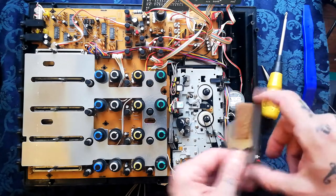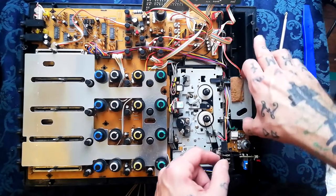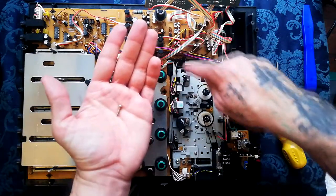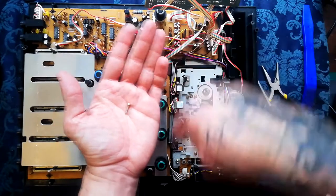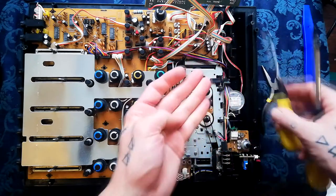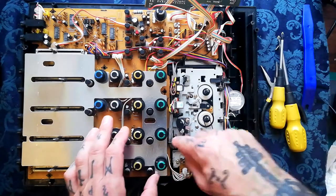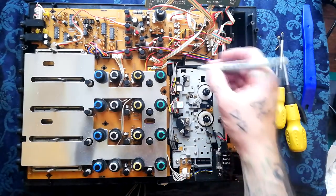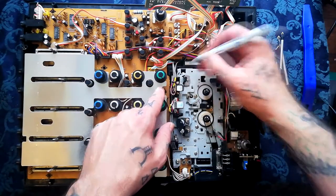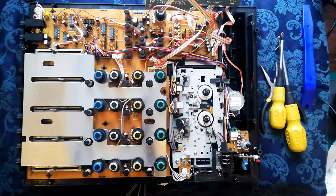There's a little metal plate that sits on top of the motor with that round lip underneath these wires. I've opened one of these before and on that one there was another screw here, but it seems to be missing on this one. These two screws go through plastic posts from the front and are narrow - you'll need a thinner Phillips head screwdriver like this one on the left. There's also a cable tie keeping all the record playback head cables out of the way. I commonly leave shorthand on metal surfaces, so I'll mark TH for thin screw and TH C/T for thin screw with cable tie.